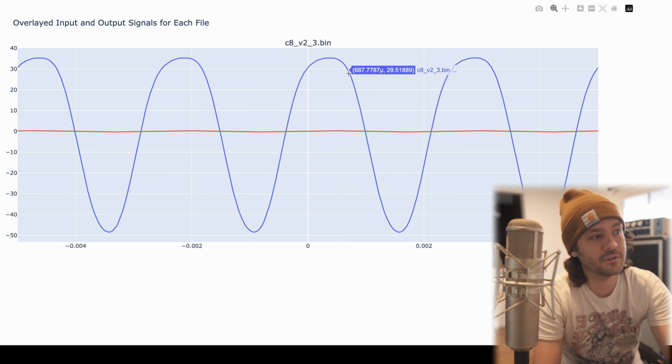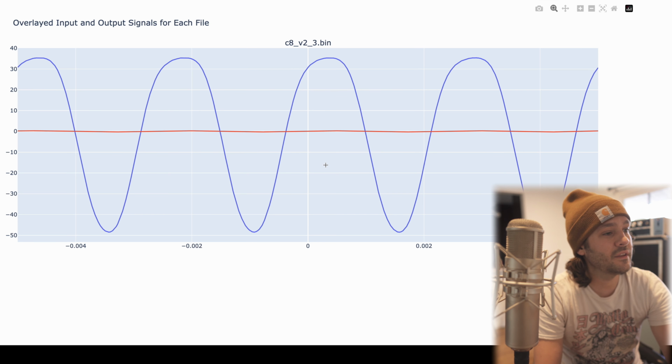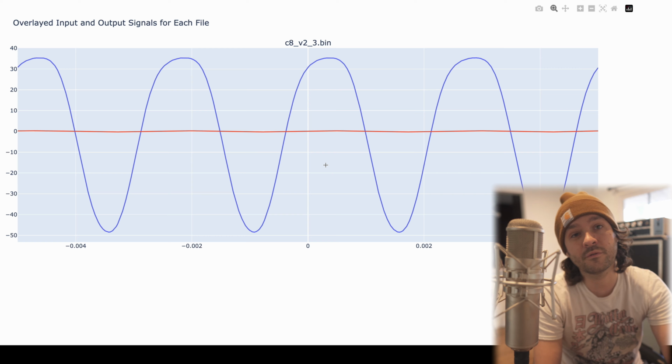It's not hard clipping, as you can see. So it's still going to be fairly musical. It's not going to be totally a fuzz pedal. But this is where the character of the amp comes from. And that's essentially why I have those early on switches for the bass and the first bright switch, because it's really crucial to get your tone shaping done there even before the tone stack.